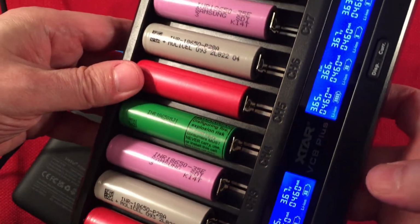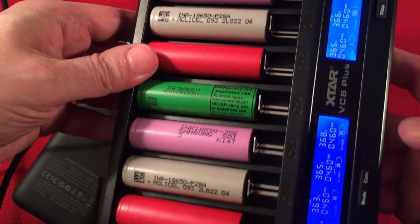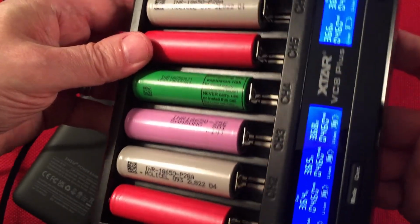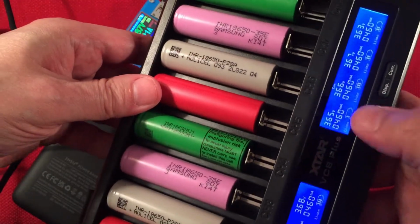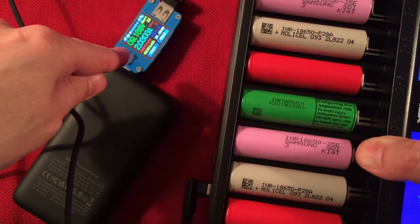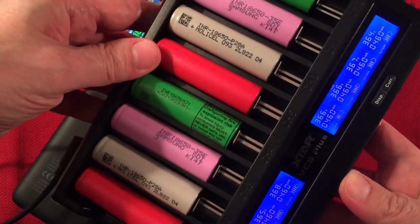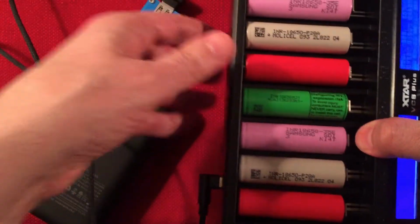So we'll go over to the second bank, and there you are. Pretty awesome. This is a great charger. And you can see it has no trouble. Now, the ones that have trouble, this will keep resetting. The charger can't handle it if this isn't delivering a nice steady 2 amp, 9 volts. So it's doing its 18 watt, no problem whatsoever. Bingo, loving it.